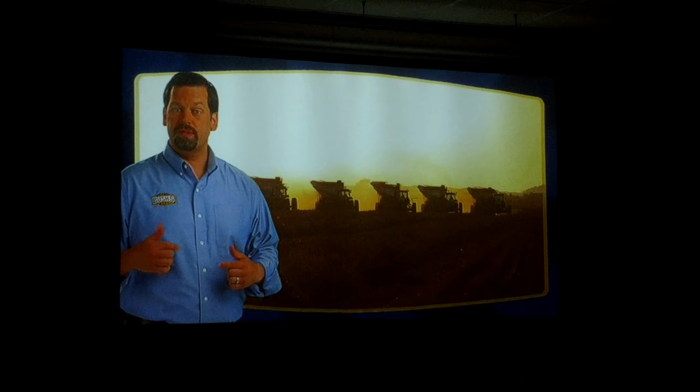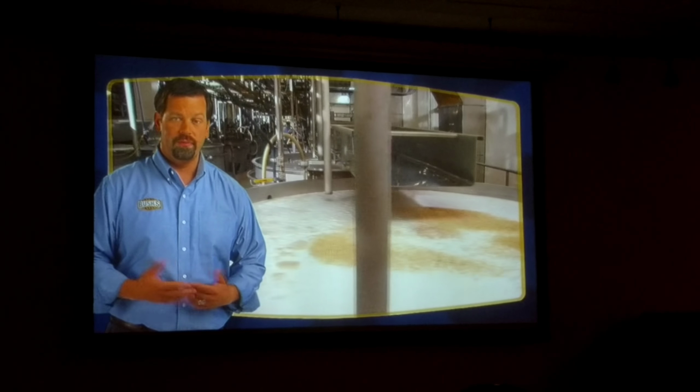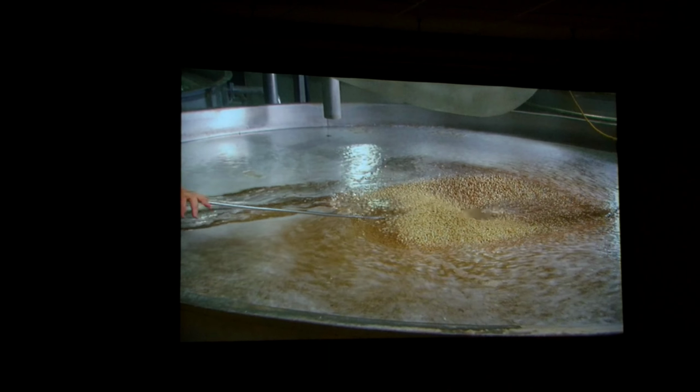The first step in canning is to soak the beans. We move the beans along a shaker conveyor to the soak tank. We put about 7,000 pounds of beans into each tank. We let them soak, and when they get fully rehydrated, they double in weight and they double in size. So we end up with about 14,000 pounds of beans in each tank when fully soaked. Next, the beans drop down out of the bottom of the tank and are on their way to be washed and cleaned. We spend a lot of time and effort washing and cleaning the beans, but we do it very gently.